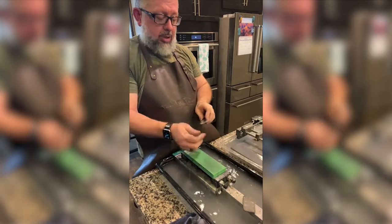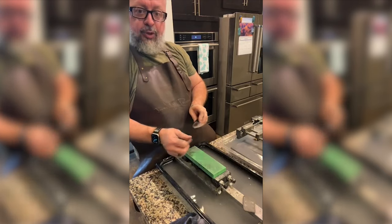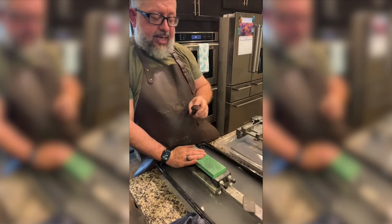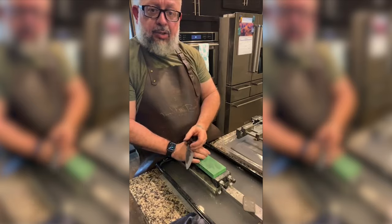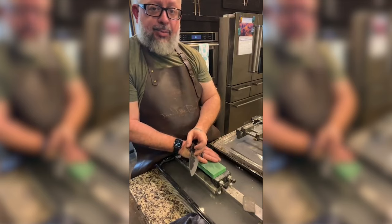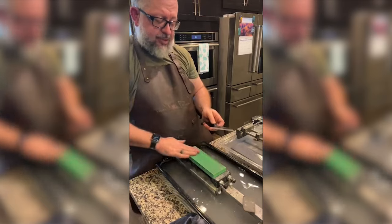So, we've been polishing this white number one Sanmai Funayuki. We're not polishing one side, we're polishing the other. I guess I've accidentally thinned the knife, because maybe I was pressing a little hard. I also even jumped up on the hira and removed some of the kuroichi, part of the learning process. And I don't mind making mistakes. So we are on a Naniwa Professional 400.